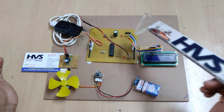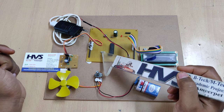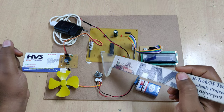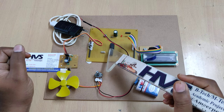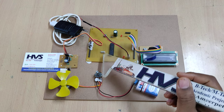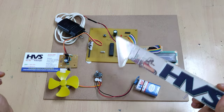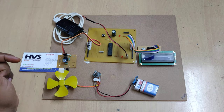On this motherboard we have three major components: one is the microcontroller, another is a crystal oscillator to provide the clock pulse to the microcontroller. The clock pulse is needed in order to read instructions — per instruction the controller needs one pulse. We are providing a 20 MHz clock frequency per second so the controller can execute 20 million instructions per second. The third component is a reset switch to restart the microcontroller — press and release so the controller resets and works from the start.